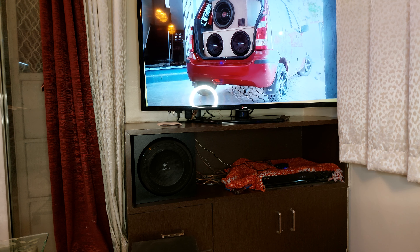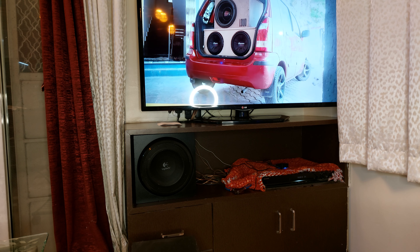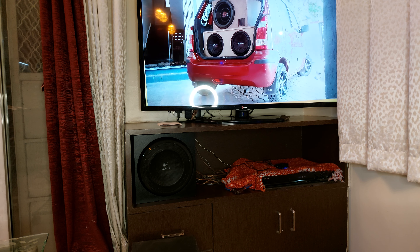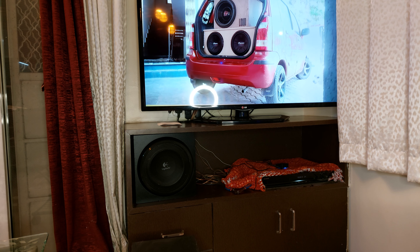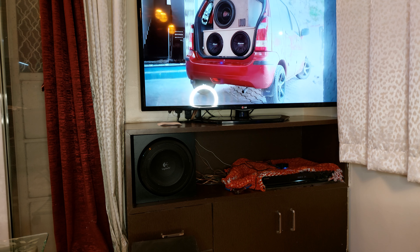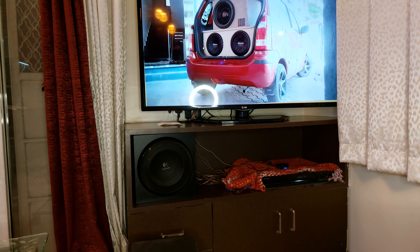Let me tell you the difference at first glance. This sub is definitely hitting the lows better, but it's not as loud as the Sony subwoofer — at least on this amplifier. Maybe on its original Logitech amplifier it might go loud, but we've connected an 8 ohm subwoofer to an amplifier designed for 3 ohms, so it's not as loud as I was expecting. Also it's throwing a lot of mid-bass, which I definitely hate — maybe because the Sony amplifier is designed to make the system sound loud.